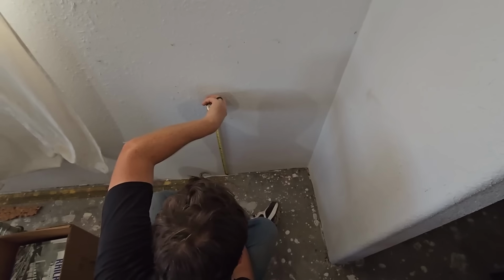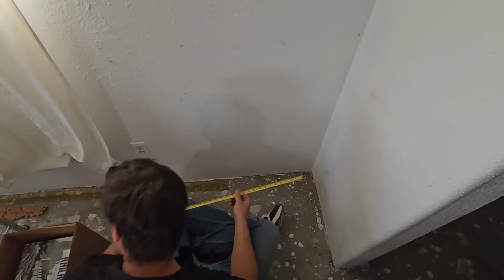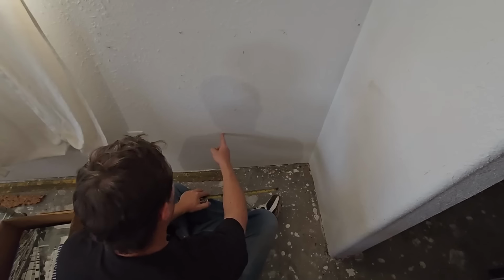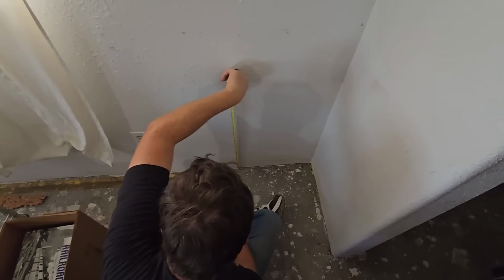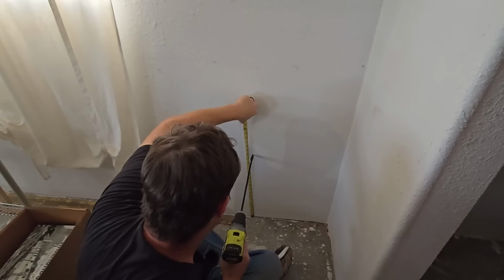These you're supposed to have more studs than that. So here's the other thing I'm worried about. Is he's got an outlet here and an outlet over there. Okay, what I'm worried about blowing a hole right here is exactly 15 inches. Is that outlet is about 15 inches. So I'm gonna go higher than that in case the wires are running like this through the studs. Okay, so I'm gonna go about 18 inches.